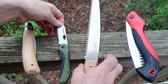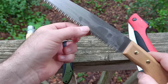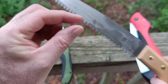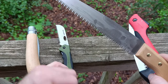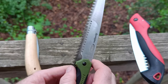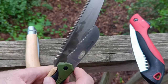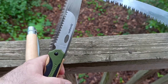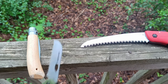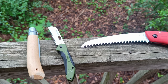The Remington is thinner at the top than at the bottom but you really don't feel that difference much. On the Japanese saw, when you pull your finger across lightly, you can feel that the teeth themselves are thicker than the rest of the blade — that's the kerf allowance. The Corona saw has the most aggressive tooth-to-valley depth ratio so far, so we'll keep that one out for comparison.